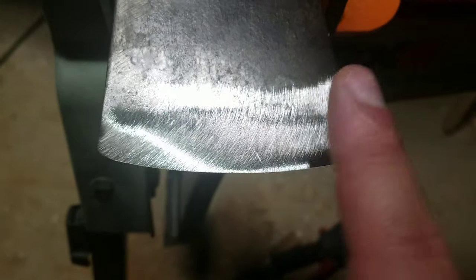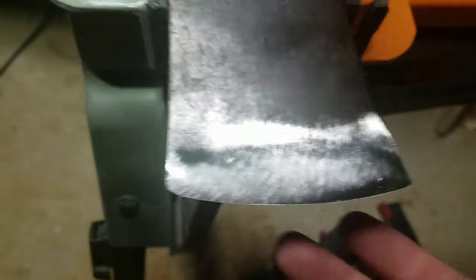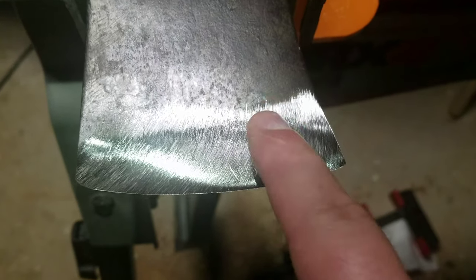This isn't the best way to sharpen but it's the easiest way to sharpen on an axe. Axes are very forgiving — there's a ton of material, as you can see, to screw up on. So you can always just take more back if your angle's messed up.